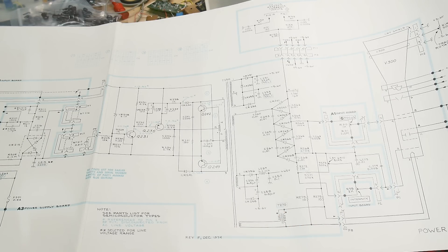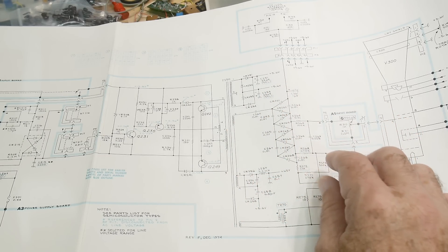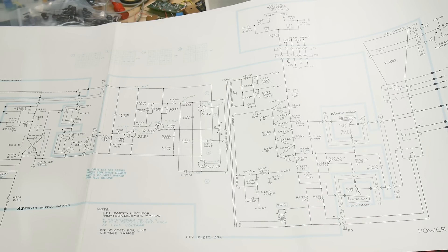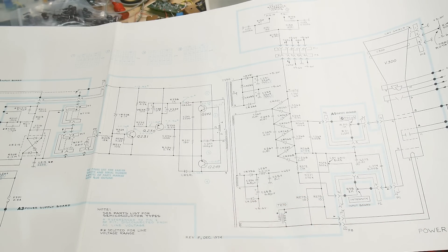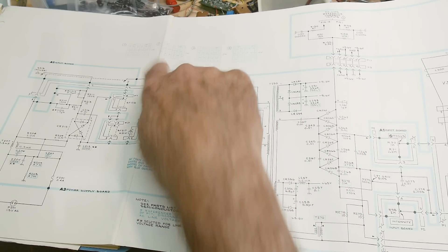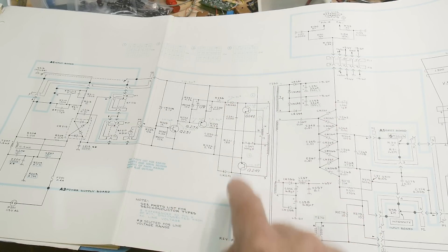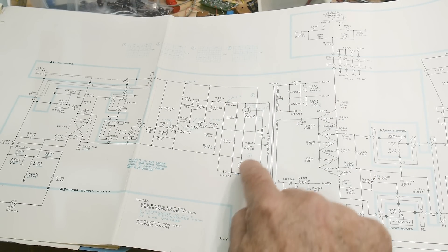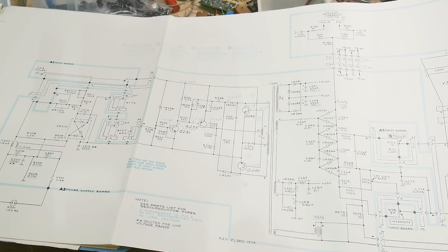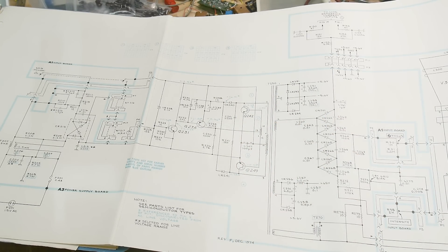There's also a section that gives you 1000 volts and 65 volts. When I first got the instrument it didn't work, and I started measuring voltages — I got 65 volts, I got the plus and minuses, and then I measured around minus 900 volts, and then it stopped working. Now it's giving me really awful voltages, and this section is not working well. There are waveforms visible at different points, and you should get a nice square wave out of these two transistors.